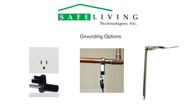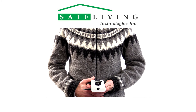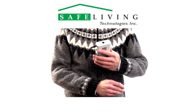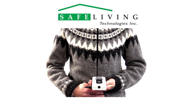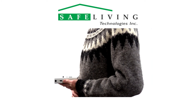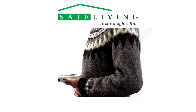After you have chosen a suitable ground connection, proceed with your readings as follows. In the area of concern, hold the meter close to your body as shown here. Notice that the grounding cable is routed down and away from the meter. Allow your hand to come in contact with any of the exposed ground connections on the side of the meter. While measuring, be sure that the person using the meter and anyone else present is located behind the meter.